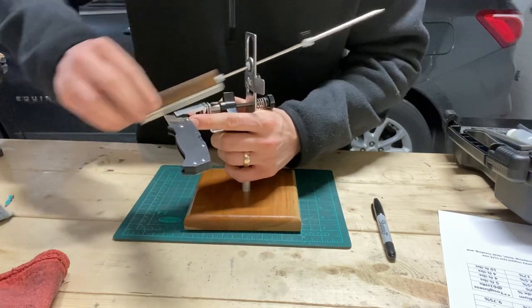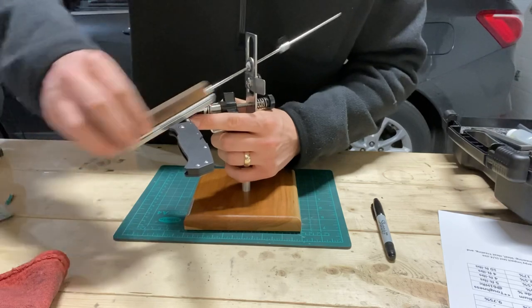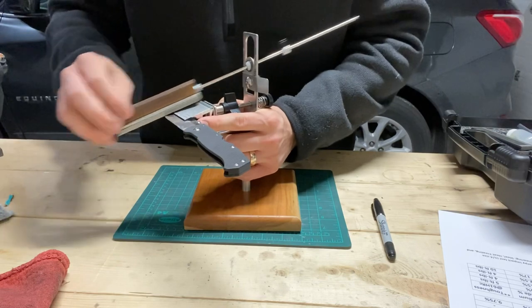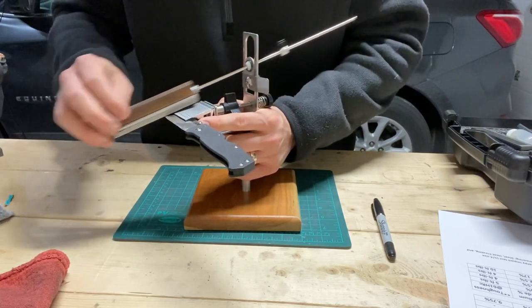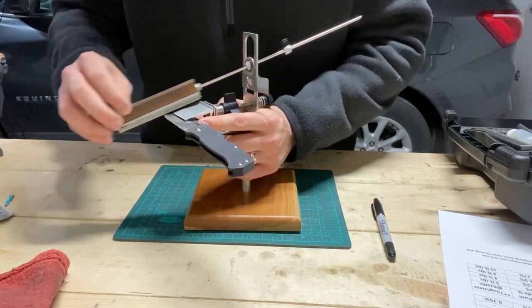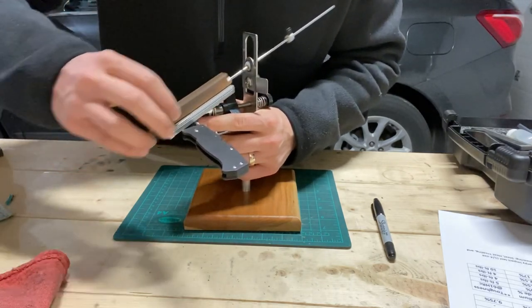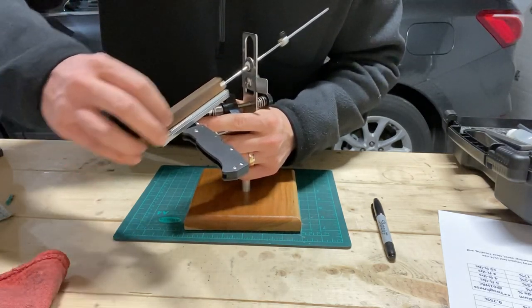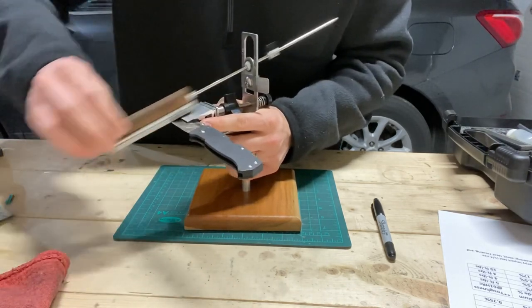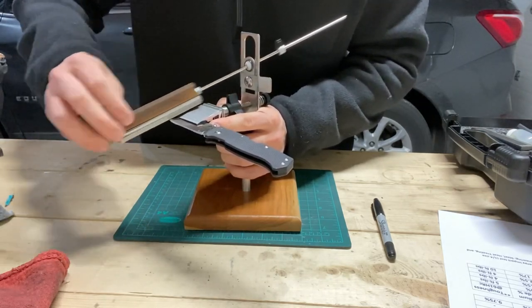Remember, when you're sharpening the tip, to not tip over too far. When you're thinking about sharpening the tip of a knife, look at the very tippy tip and imagine that little metal molecule way out there at the tippy tip. You're gonna wanna leave that last molecule on there. You wanna remove everything behind it, but leave the last tippy tip molecule. And that's the best way to visualize what you're doing, and will kind of keep you from wanting to round that tip over.